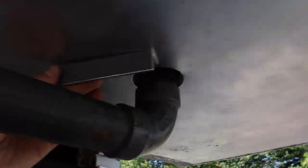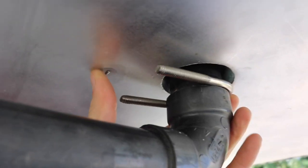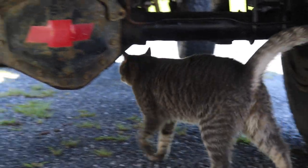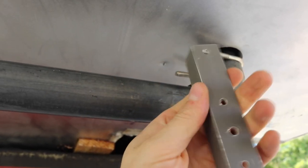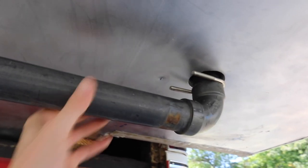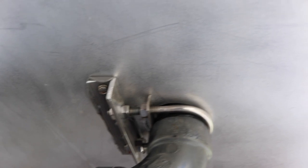The drain is still a bit loose, so the plan is to take a piece of angle iron and bolt it up, then use a stainless steel u-bolt to fasten it in. I've got stainless hardware to hold the angle — it's aluminum, scuffed for painting later. We're doing butyl tape behind it to make it waterproof. Got it completed — had to use double nuts and a backing plate to keep it really stable. Trimmed the butyl tape, caulked it, and added blue Loctite so it doesn't vibrate loose. It's definitely stout now.